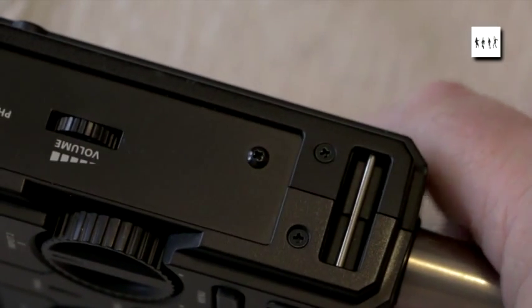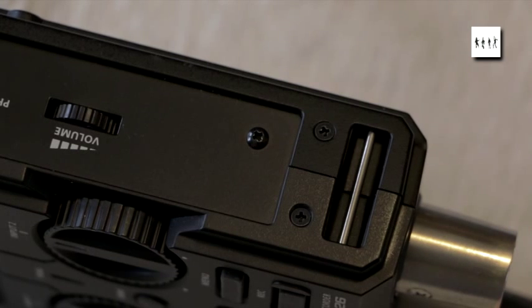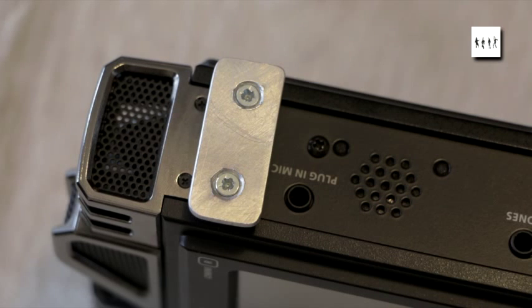The front and rear parts of the R26 body casing are held on by a set of screws. They are very small — in fact they are M2 by 0.25, which is a very fine thread. I'd hoped to replace these screws with longer ones that would go through the flanges and would be of the correct size and pitch. However it turns out that this is a very uncommon thread pitch. Consequently, since the device is out of warranty, I decided to just tap the holes through for the four screws to M2.5 with a standard pitch, and that's absolutely fine.